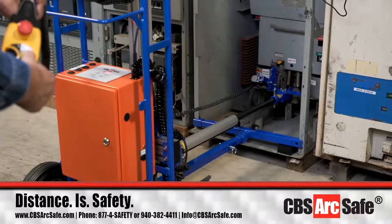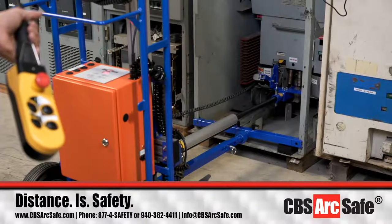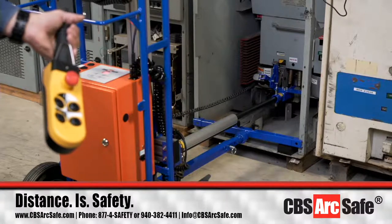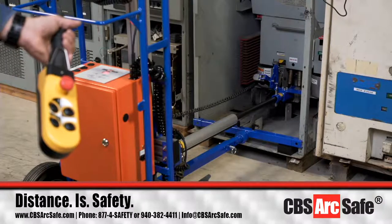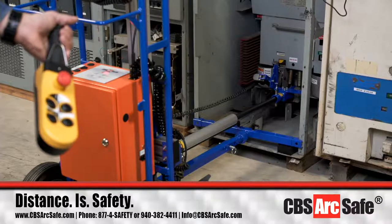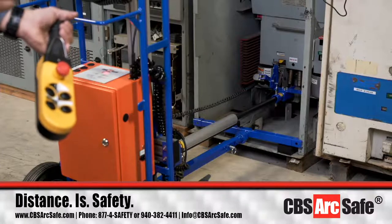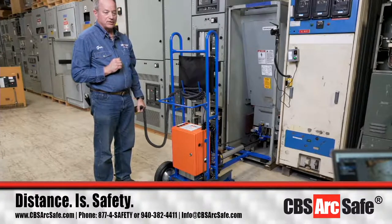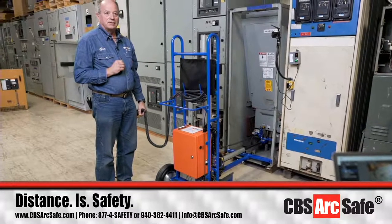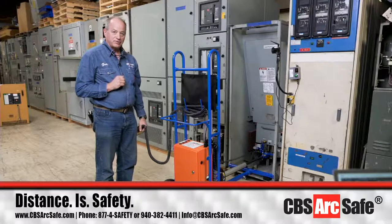To go from test to connect, defeat the latch one more time and go all the way in. Release the foot latch and it stops the progress of the breaker — the breaker is now in the connected position. When bringing a breaker out, I normally don't stop at test or disconnect; I simply bring the breaker out and nudge it back to the disconnect position. Hold the button down until you're ready to stop movement — don't be pulsing this type of circuit breaker in small increments unless you're right at a stop position. These devices are in use around the world: the Middle East, Canada, South America, Australia, Malaysia, and numerous other countries.